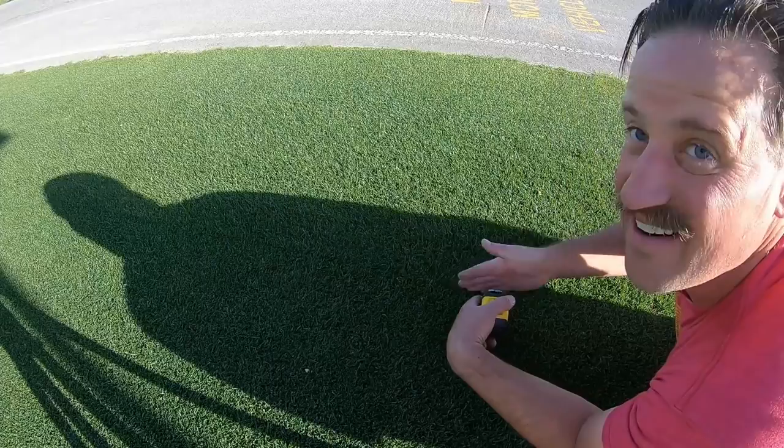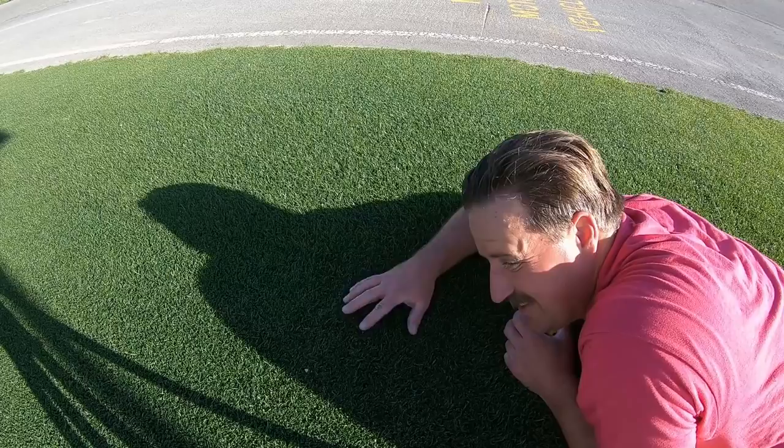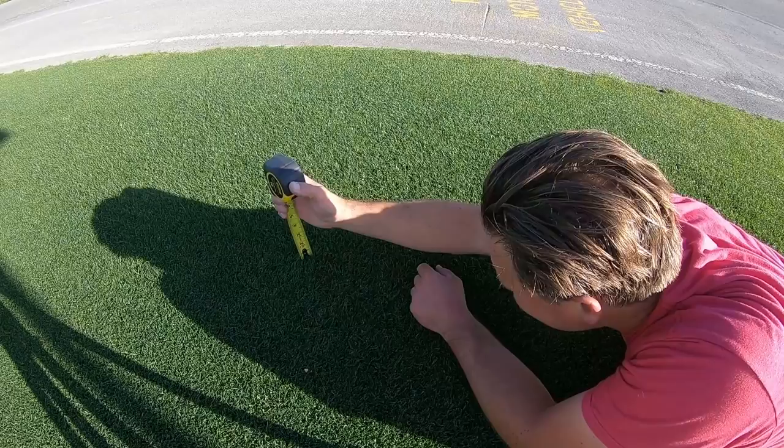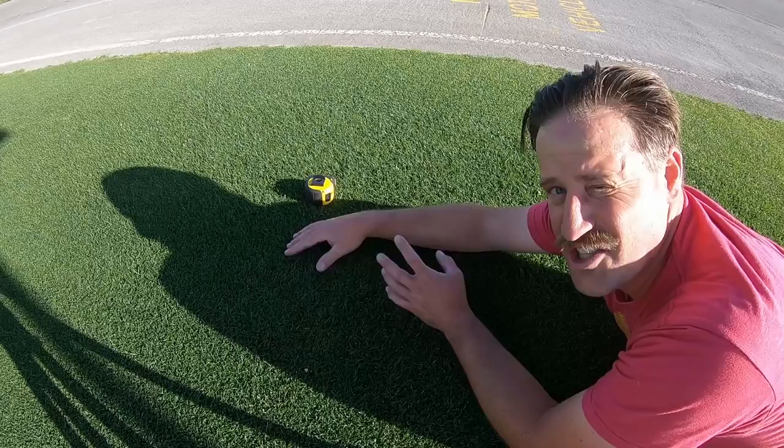Here's the cut line right here — the mower bench height of cut is set to five eighths of an inch. I see quite a few long stragglers as I get down here and look. It actually looks like it needs a double cut. It's really cutting at around five eighths of an inch on this side, but these pieces here are about three quarters of an inch.